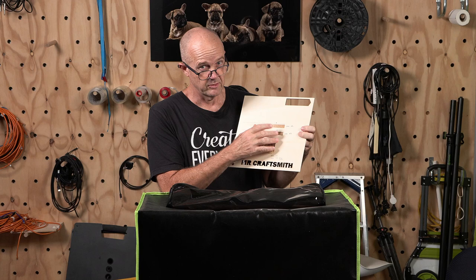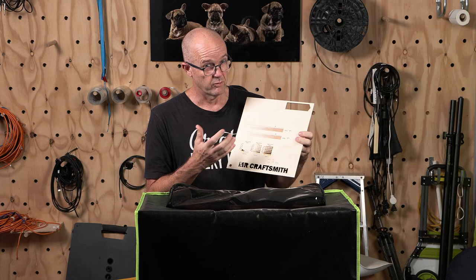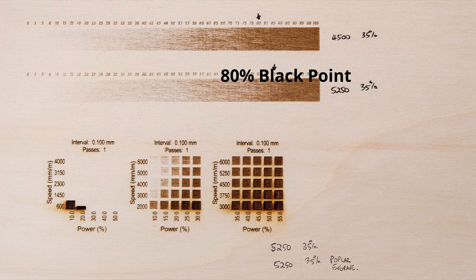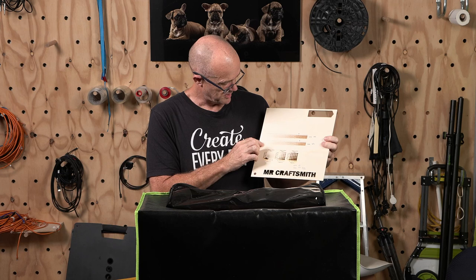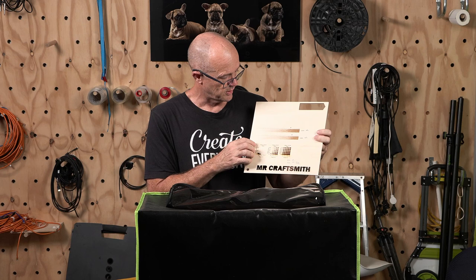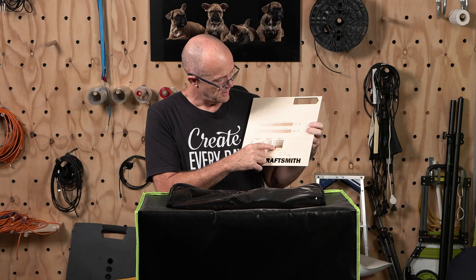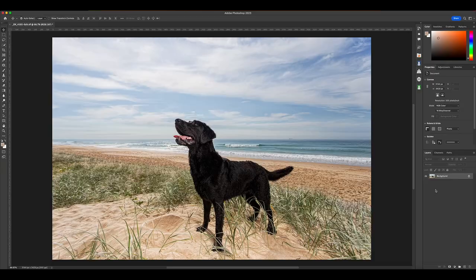I also tried it at a different speed, slowing it down to effectively give me more of a burn, and you can see quite clearly that was actually down to 80% dynamic range. So it really is important to optimize that setting to give you the maximum dynamic range within your engrave. Looking at the bottom end, between zero and 5% there isn't really much difference for our white point. Through these burn tests we established that our optimal setting was 5,250 millimetres per minute at 35% power level.